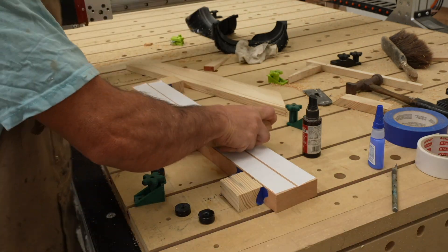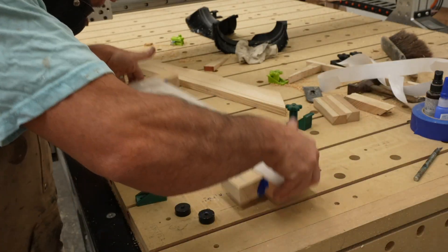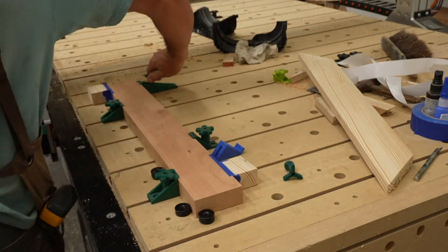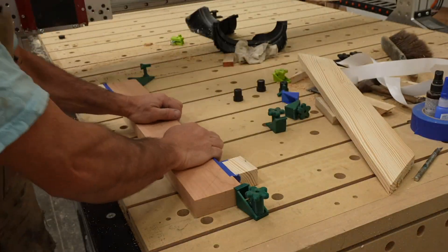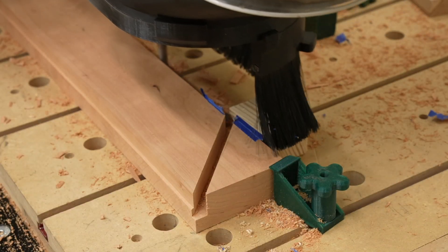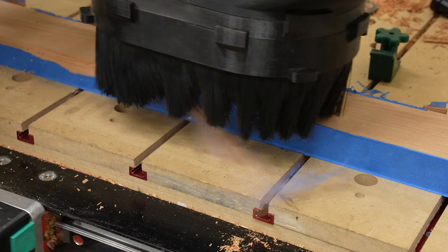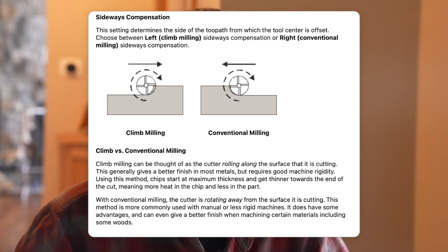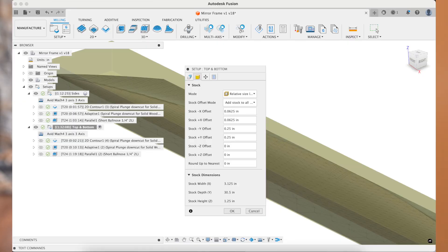I needed to machine the entire top of the piece, so I had to use double-sided tape to hold my workpiece down. I squished it hard against the table using clamps temporarily, then removed the clamps. I left two clamps on where I knew the bit would not hit them. The CNC machining started with a 2D contour to cut the outside of the shape. I was immediately getting chip-out on the side — the problem was I was doing a conventional cut when I should have been doing a climb cut. Switching to a climb cut gave me a much better finish. Also, I had my stock an eighth of an inch thicker on each side, which was too much material. Changing it to a sixteenth of an inch gave me no chip-out.